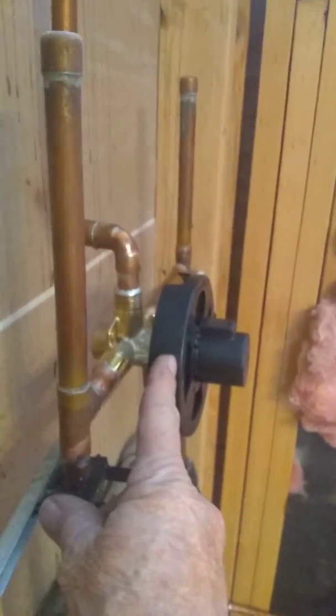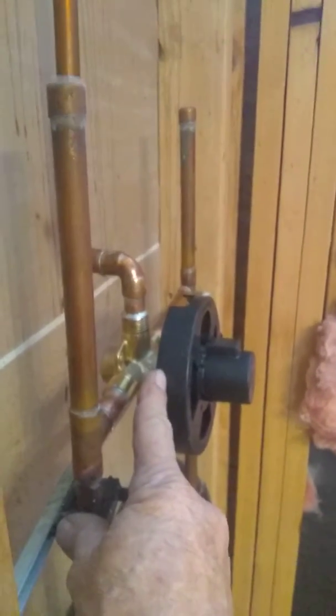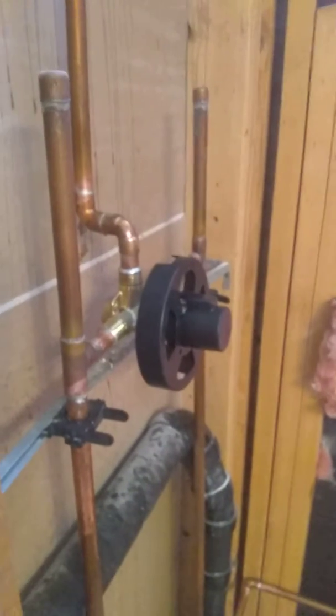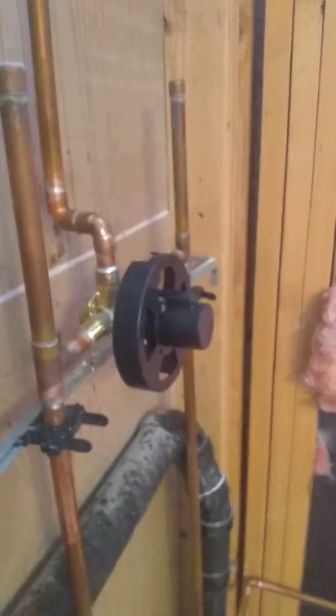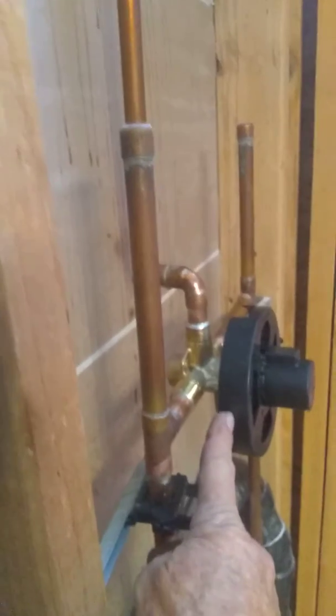Look at it like this. You see that is at about an inch and a half. So as long as they land that new tile in this area, even if it's back here, it should be fine. And the reason for that is the trim is set up for a certain depth. And by depth, I mean how far it's in or out of the wall. Normally right near the face of the wall is good. For tile, I like to leave an inch and a quarter to the center of this.